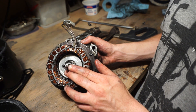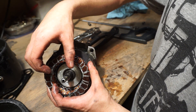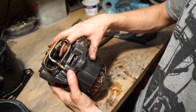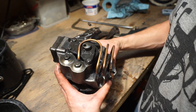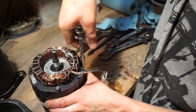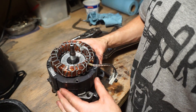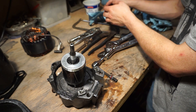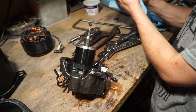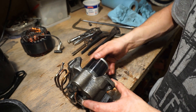This is actually an oil pump — kind of works like a centrifuge. This sits down into the oil in the bottom, and as this spins, it kind of slings the oil up because the oil wants to sling out. It's larger here so it kind of acts as a pump, and that gets oil up into these bearings up here — it's just cast iron on cast iron, it looks like. So, the field windings are off. Honestly, I think this would probably do as a flywheel. We probably don't really need to make a bigger flywheel than that — that's a fairly decent chunk of metal right there.